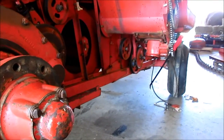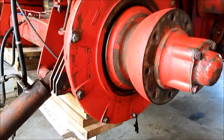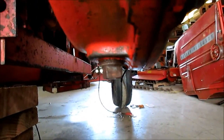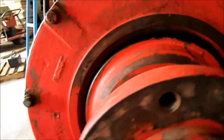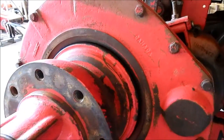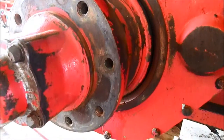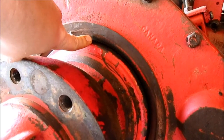I've heated our eccentric back there. I'm going to work now on removing the final drive outer cap here. First things first, I've got to drain the oil — it's a 5/8ths of an inch drain plug. It's pretty self-explanatory; in the manual it says pull this off, inspect it, make sure you don't have any ripped-off cogs or anything. I've never had anything like that in my experience. Replace this O-ring, or gasket seal as they call it in the manual.